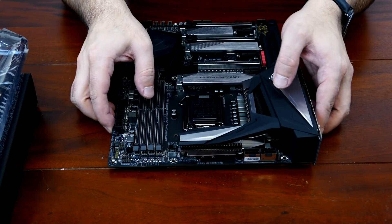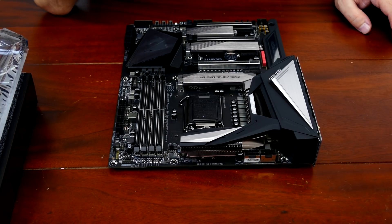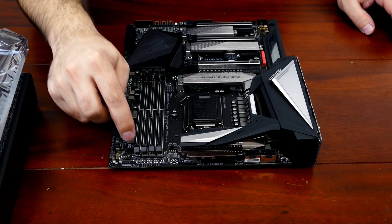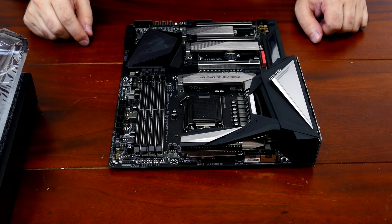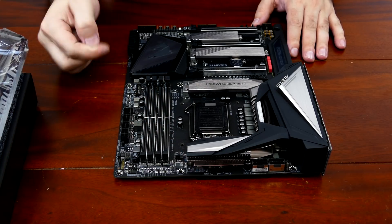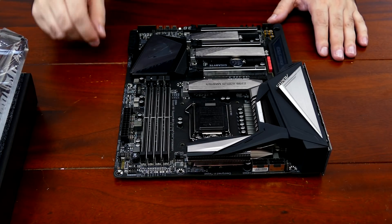We've got a fan header there, designed in Taipei — they should be proud of that. We have an RGB header, a digital RGB header, and an RGB voltage selection jumper. By default it's on 5V and you can switch it to 12V. There's also an OC button header — it's labeled 'auto OC,' seems to be a toggle with three pins, so maybe they'll sell an accessory for it. Two more fan headers here, another fan header, and an EC sensor — EC stands for embedded controller, a secondary controller that handles fan control and other tasks the super I/O doesn't have enough pins for.